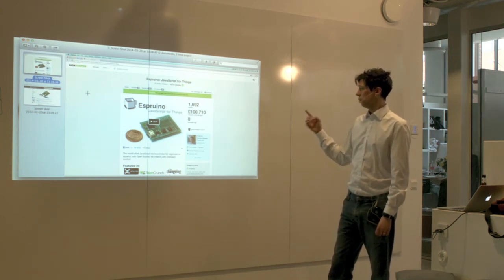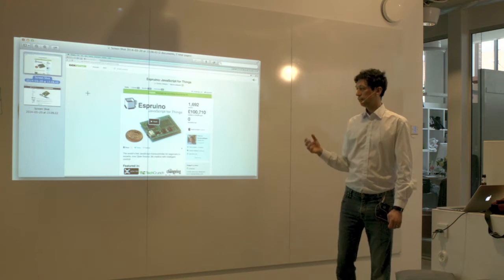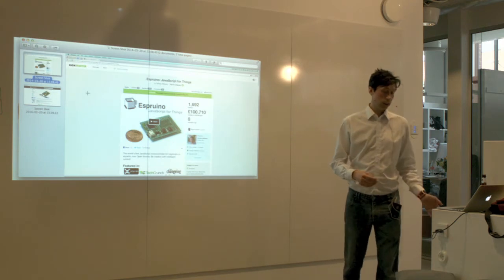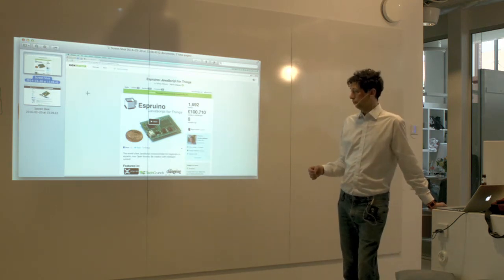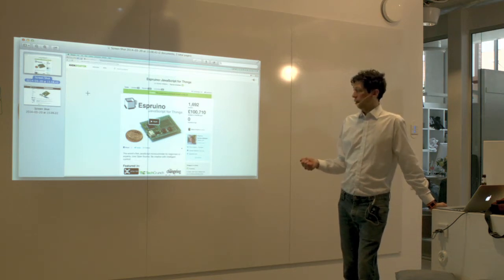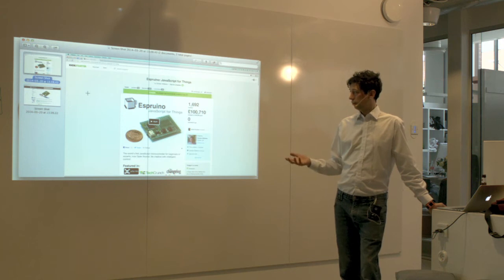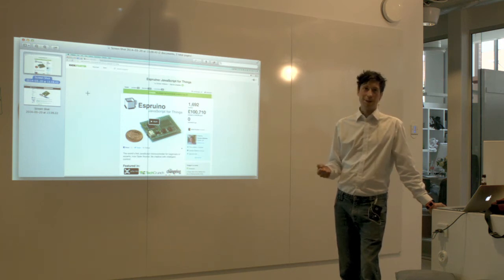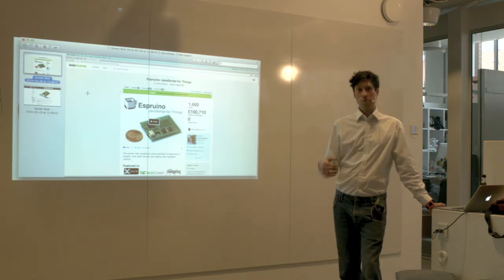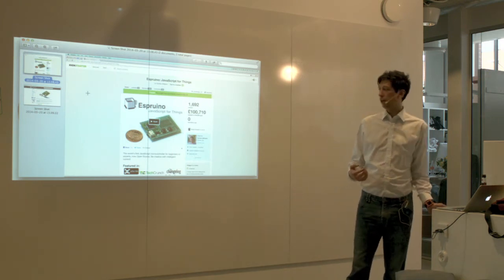So Gordon Williams started by writing software. He wrote a specific firmware for Arduino boards that could run JavaScript. And he did that for quite some time, I think, and tried to make it very efficient and very small. He came to a point where it became a big problem that every time he needed to do a driver, he had to write it in plain text. So the drivers are in JavaScript, and the JavaScript is not being compiled into something else. It's actually being run just-in-time inside the microcontroller.